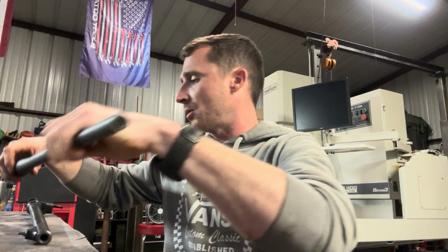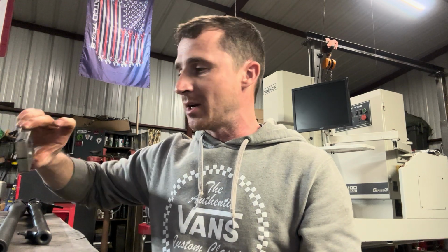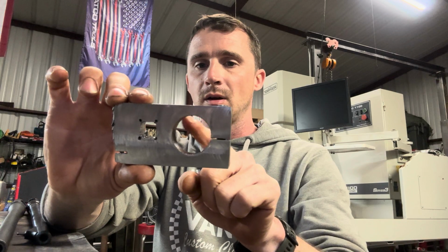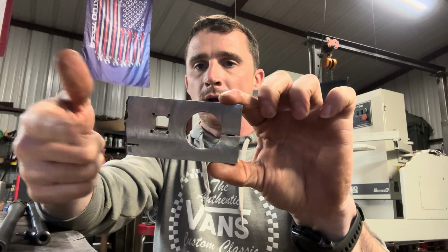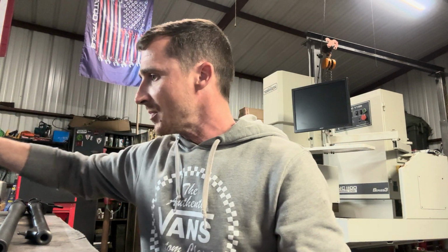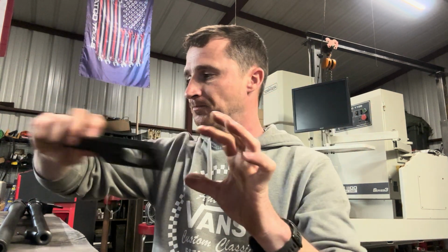And so this requires my least favorite barrel nut wrench, something like this. It is cut to the OD of that barrel nut, and then it is clamped on and a torque wrench used to set the torque. This is a shop-made tool, but there are also commercial-made tools for the job.